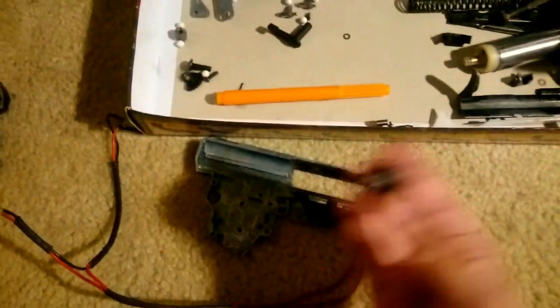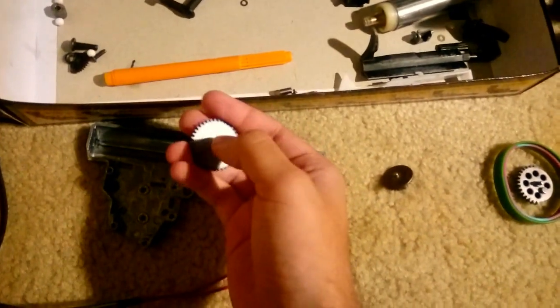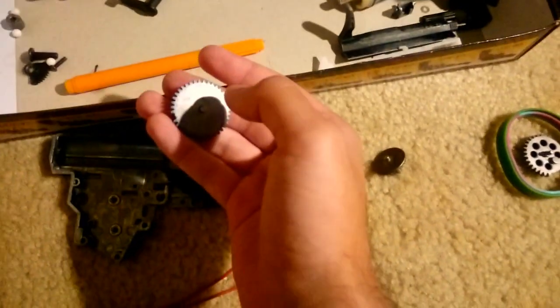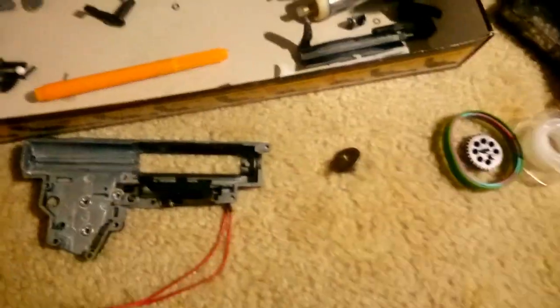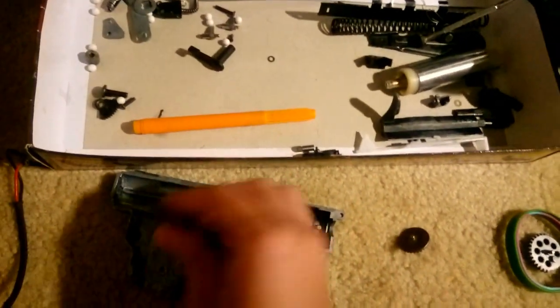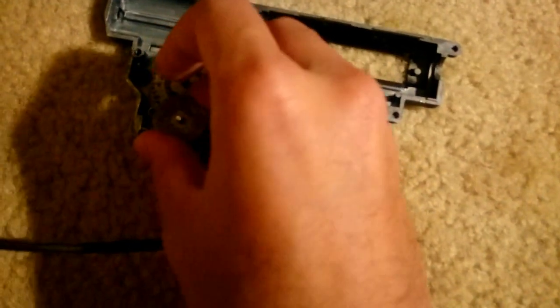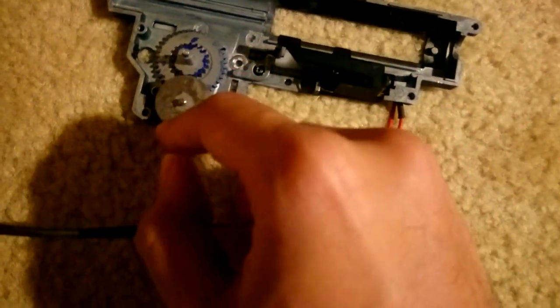You're going to have it all with a single wobbly gear. When you stick these things in, you have to make sure the shims are on them properly. You have the lubricant under here, just on there in this little spot, and then you stick the shims on there — it's creamy so the shims don't come off. You have to put lubricant in between the shims. That's the first gear to go in, here's the second. Make sure both sides, both of the shim areas, are lubricated — it'll reduce the wear in the gearbox a lot.